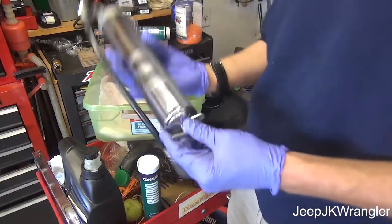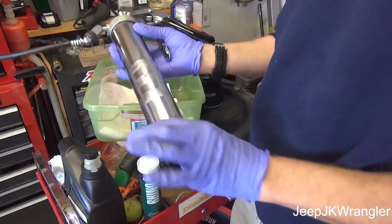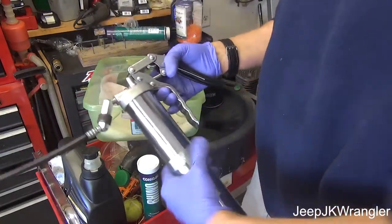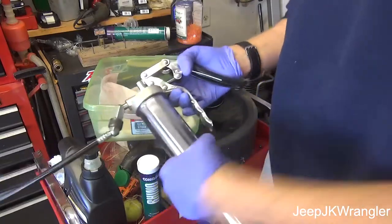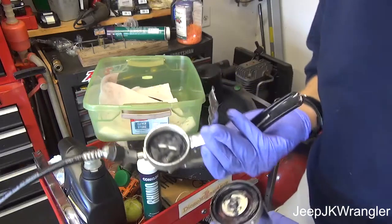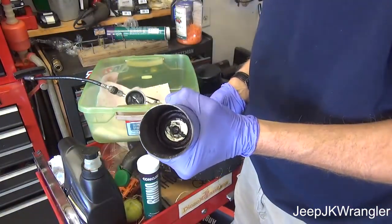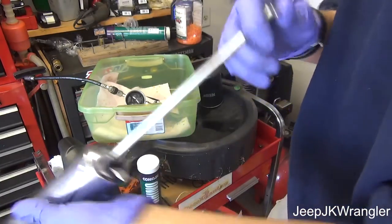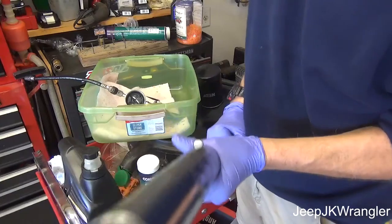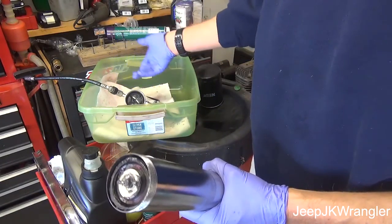For the ones that operate off the 14 ounce grease cartridges, we're going to show you how to do that. I'm going to unscrew the body. This part is called the head, or the trigger assembly. There's a small port in there, and inside is a plunger that we can pull back like this. There's a tab right here which is how we release it.